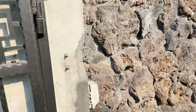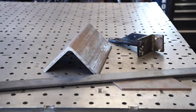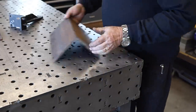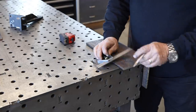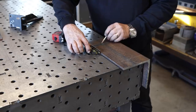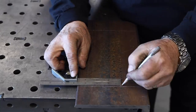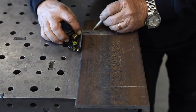The material of choice here is some six-inch angle iron, five-sixteenths of an inch thick, and it's about a foot long. I've also got some three-sixteenths flat metal and a piece of three-eighths by two-inch flat bar stock. The very first thing I'm doing is scribing and cutting four holes on either side. The holes are marked slightly off-center so they can have a bigger bite inside of the column.